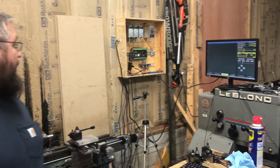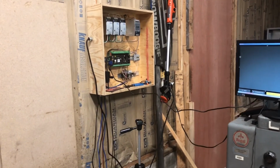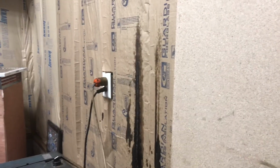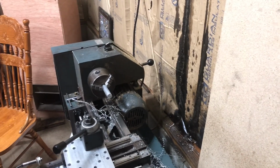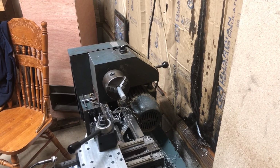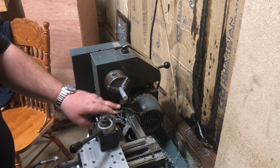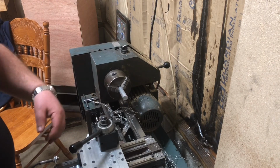So we're going to set you down in the tripod here, and we'll fire this thing up, and you guys can see it run once, see what you think. Get you lined up. At least this ain't as noisy as the mill was when we first started. Spindle's a little quieter. We've got the tool set up. We're already zeroed here off of Z, and we've done a control Z. We're backed off the part.